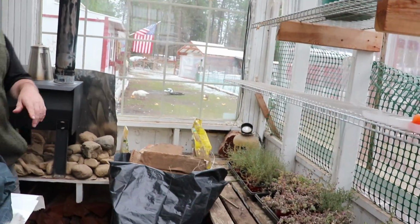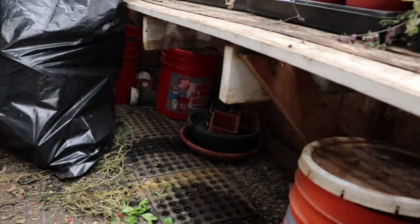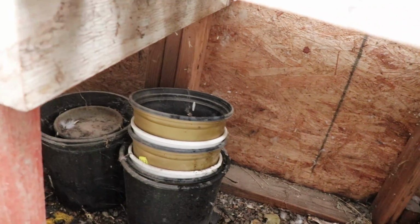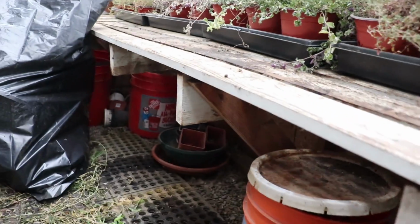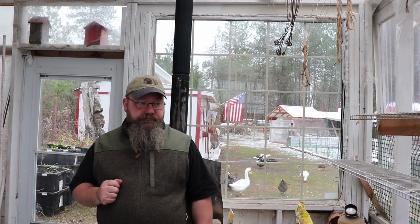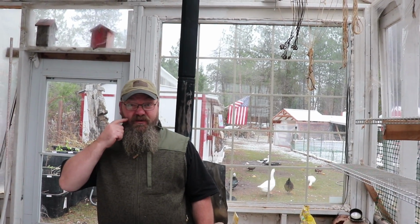Oh yeah, my bad. We're going to take all of the shelves off here, and then insulate all the way around the outside, and add another layer of OSB, get all that painted up and sealed up. That'll add another layer for when the snow is sitting against the outer wall in the spring, so it's not transferring that cold through. And again, that'll help us with the efficiency.